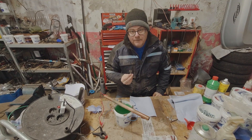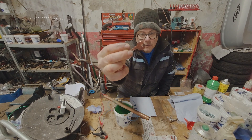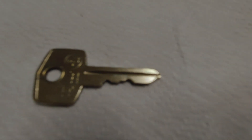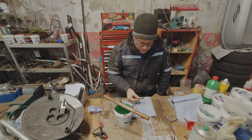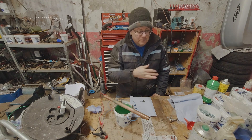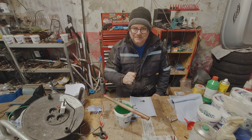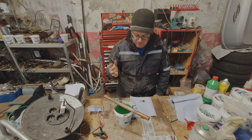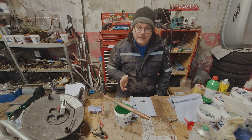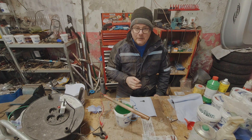It really only took about five minutes. As you can see, it's solid color all the way around. I didn't need a lot of buildup — I was just wanting to change the color because the brass was showing through. This solution will last a long time. You can put it back in the vinegar bottle and save it till next time. Just mark it so you don't think it's vinegar. It's a really handy process to know and a good thing to set up in your shop. There are many, many uses for it — I highly recommend it.